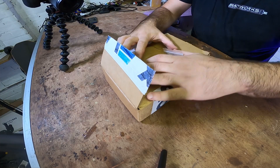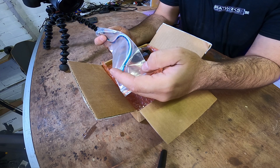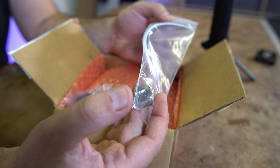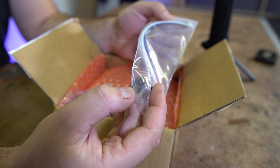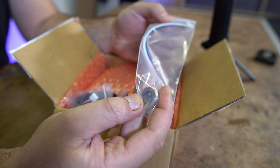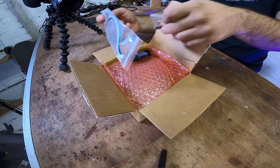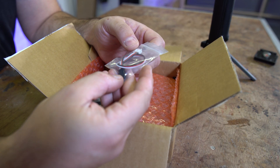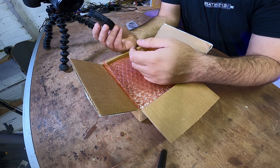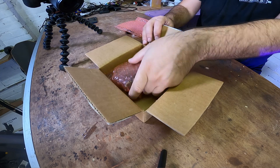The first thing we get is the on/off switch. This is an RGB switch that can display different colours — the Stormcore is programmed to give you battery information on the LED. It goes from red to blue to green to indicate battery status at roughly 25%, 50%, and 75%. That's pretty cool, definitely an upgrade from its predecessor the Fockbox Unity. We also get a servo-to-JST 3-pin adapter if you want to run a PWM or PPM remote, and a USB-C cable for programming.